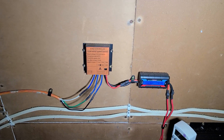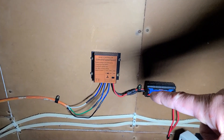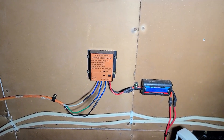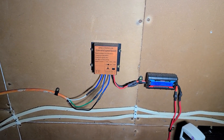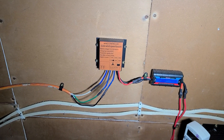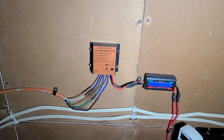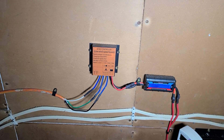I ran it to my wind controller. Now that thing said you should hook it up to the battery first and then to the charge controller, or you might damage it. I did it backwards, so I don't know if I'm actually getting what I should be out of this because I may have damaged the charge controller. I have a new one coming today and I'll update in the next video to show you how I install that.